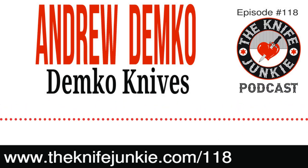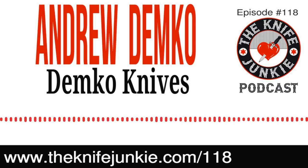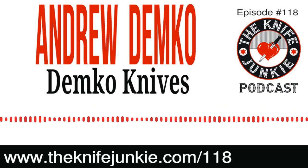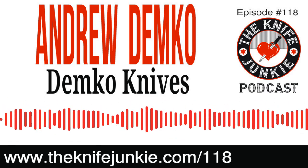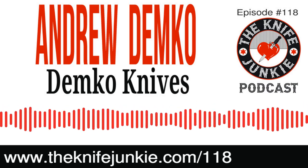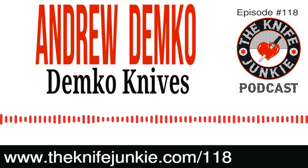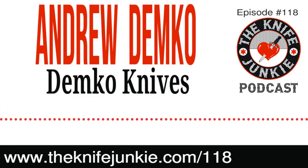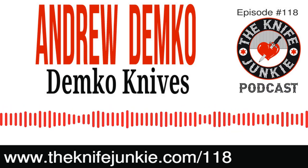There's a wedge — it's clearly a wedged part — but it also allows the lock to move back and upward, which is key to making it really good. First I had it like a fork, with the wedge moving between the tang and the pin, with the thumb release on top. But sometimes when I unlocked it too hard, it would totally come out of the knife and the spring would shoot. Instead of having a fully enclosed locking mechanism, I had this fork with an eighth-inch pin and a compression spring around the pin like a strut, and it would shoot out.